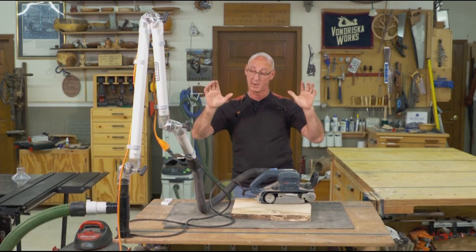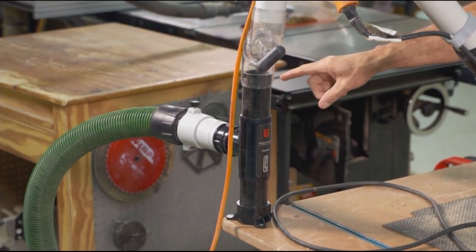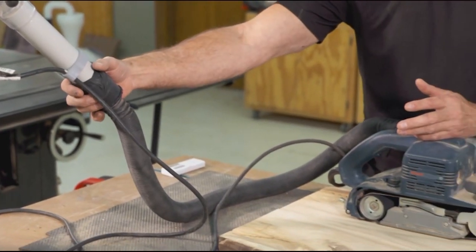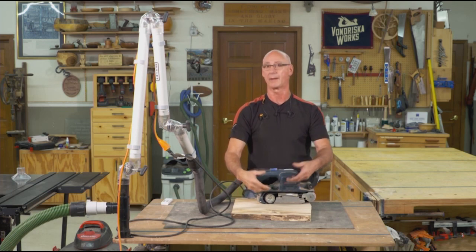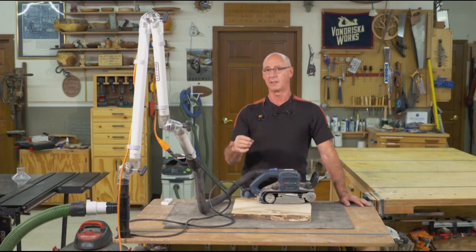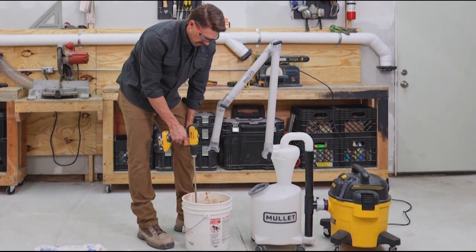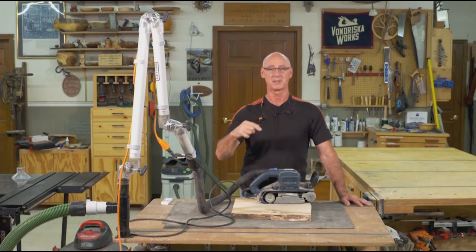Here's another thing I really like about this setup — I've moved the boom arm to my bench. With this mount I can tee this out to my shop vacuum and still have all the advantages of the articulating arm. Whether I'm connected to a hose running to my sander or I put the collection point back on for carving at the bench, it's very flexible. With its mobility you could also use this when turning on a lathe — a spot where you produce lots of dust and shavings — or even under drywalling applications, another incredibly dusty job. There's a lot you can do with the boom arm to pick up dust right at the source.